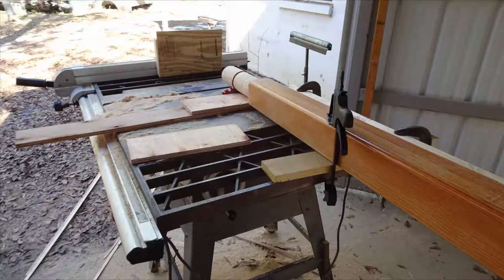After considerable thinking outside of the box, we finally realized that we did not need to put the bowsprit in a wood lathe, which we didn't have because it was over 8 feet long. Instead, we could simply take a dado blade on a table saw and rotate the bowsprit slowly over this dado blade, and we would get our circular end of the bowsprit. So here's the setup we used.